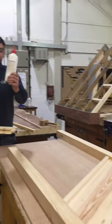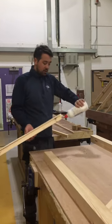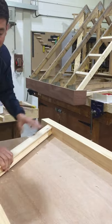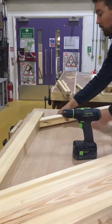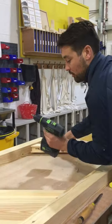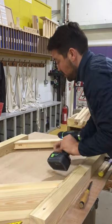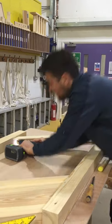So when you do it for your EPA or your assessment, you want to use good quality wood glue. There's plenty of wood glue on there and on there. We're going to slide it in like so and it should be a nice tight fit. Then on site I drive a 70 or 100mm screw in through here — I've got the drill on number one so I'm going to get a real nice tight fix through there.